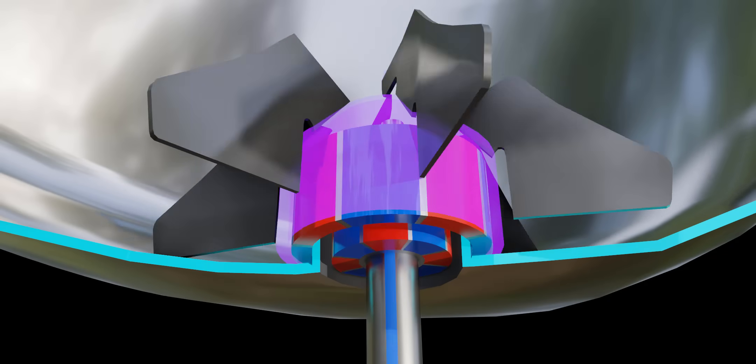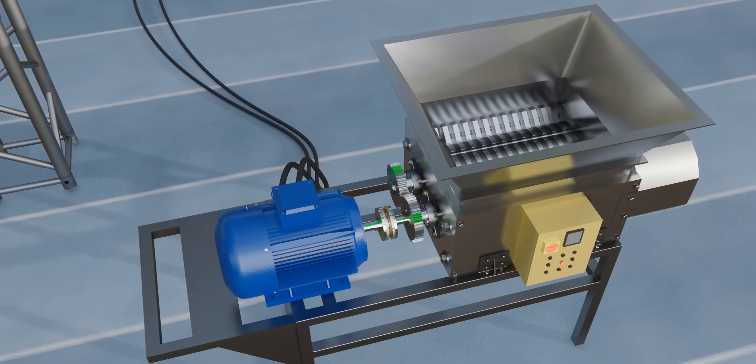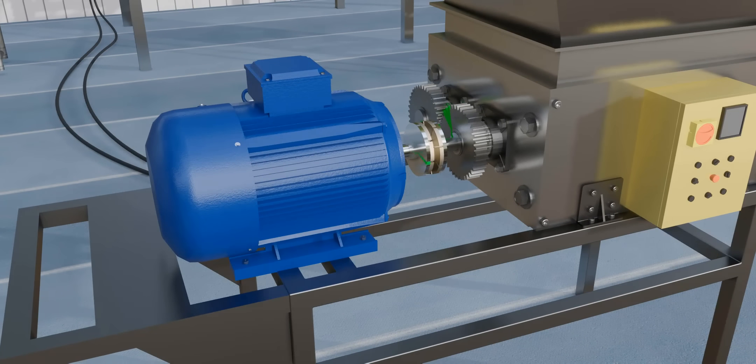Let's now use an axial magnetic coupler in a crusher. Here again, both rotors are isolated. If the load on the driven component is large, the two parts will move out of synchronism and cease transmission of torque. This prevents damage of the crusher and deformation of the shaft. The motor is also saved from overloading here.